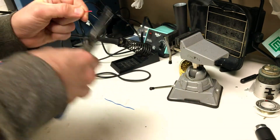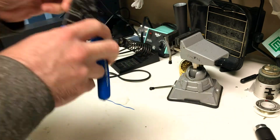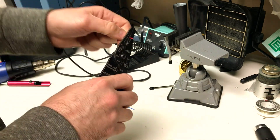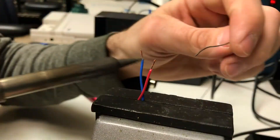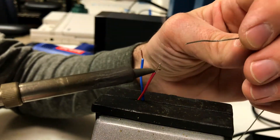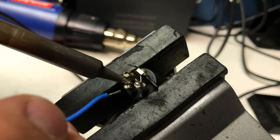You're going to take your wire and strip the ends of it. Make sure if you've got any random pieces of stranded wire that you smooth them out and you've got a good clean straight piece of wire. Then you're going to tin the ends of those cables — this is going to help the solder flow and attach the cable much easier.